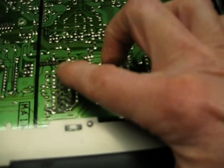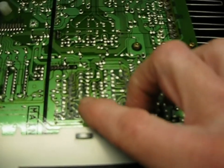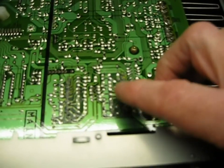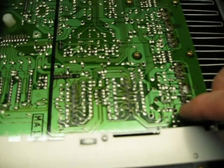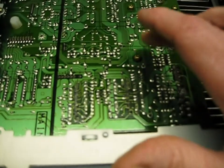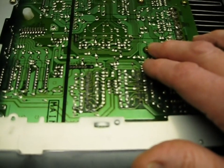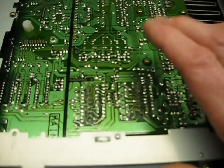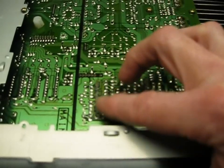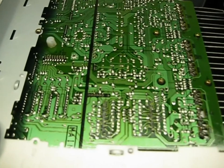The reason why these solder joints fail is because of heating and cooling and dissimilar metals, and because they're probably lead-free solder they wind up cracking like that. I haven't plugged this in since I picked it up because of the physical damage, but if it didn't have the physical damage and I plugged it in, I think there would be no symptoms here because mine weren't bad enough. But if they get to the point where they're really breaking loose, they can wind up taking out other components with them.